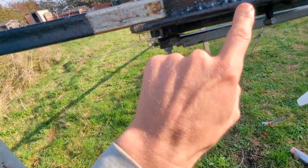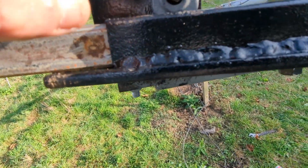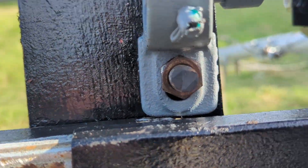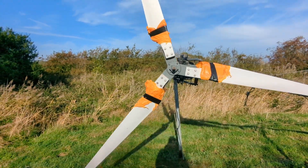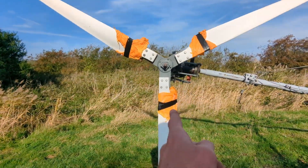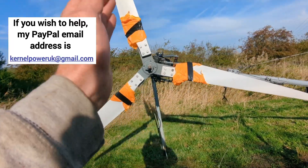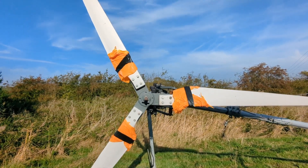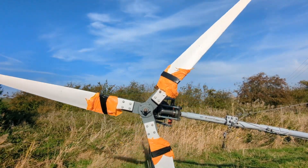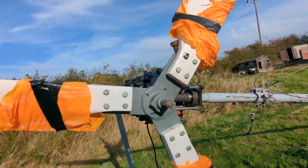The tail isn't all the way in. That hole there was an absolute massive pain to drill — you can see there is very little room there. We'll just see where it stops and what it does, because obviously the wind's hitting it from behind me to the turbine face on almost, so we expect it to move around in a clockwise direction. That's not quite done yet because it shouldn't be rolling back. More adjustments — I'm pretty happy with that, I think it's about as close as I'm going to get.